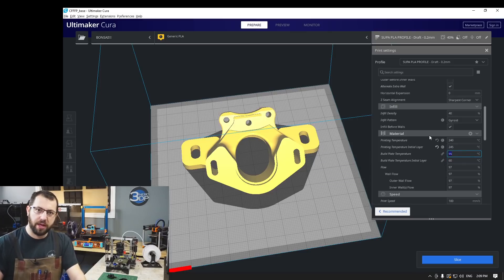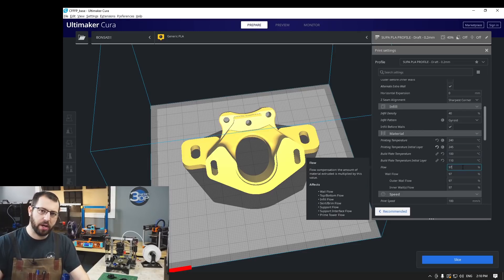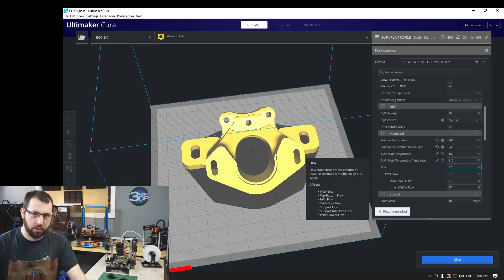You can do the same thing with your bed. I find most ABSs like a bed temperature of anywhere from 95 to 110 degrees Celsius. You'll have to adjust based on how the plastic is sticking to your bed and your bed material accordingly. When it comes to flow rate, you are going to have to adjust this if you've never printed ABS before. It has a different density than other plastics, and it contracts when cooling at a different rate. So you are going to have to do a flow test to make sure your flow rate is adjusted accordingly before moving on.